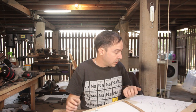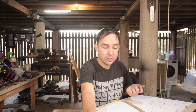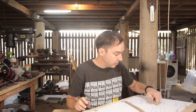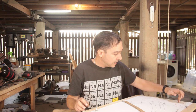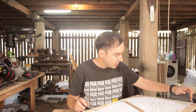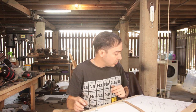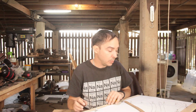This piece of work involves a lot of complexities: taper drawing, scroll forming, collar setting, curves to position, a blacksmith's ball, set down tenons, forged end finials, tapers, right angle corners, upset corners, and a lot of punched holes. So this should be quite an entertaining project.